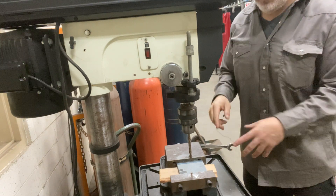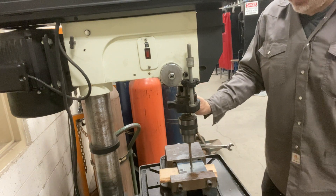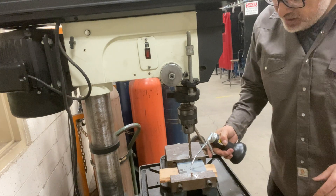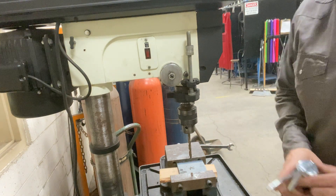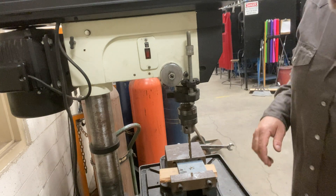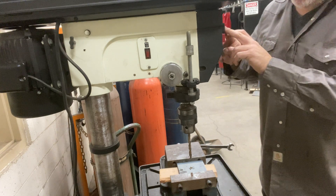Remember, four inches away from the bit while it's moving. I'm away now and I'm wearing my safety goggles. I'm gonna turn on the drill and go just a tiny bit into the hole. Then give it a baby squirt of cutting oil to help the drill bit work. You don't want to use a lot of cutting oil because when you weld, that cutting oil will burn off and put impurities in your weld — just a tiny bit to help the drill bit go.